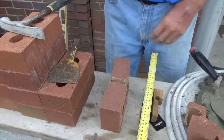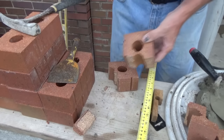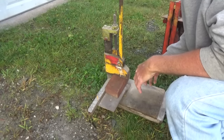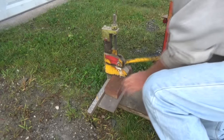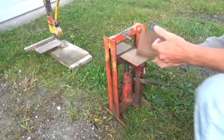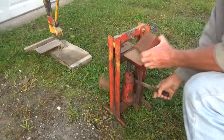It will always break right. If you can get away doing it this way, it's better. Back in the 60s and 70s there was no brick saws - saws didn't really come out until about the 80s. You put a brick in here and you snap it. That's how we would do it - that was one of our machines. As technology advanced we'd get this one, it would be called a snapper, hydraulic. You're going to snap it.